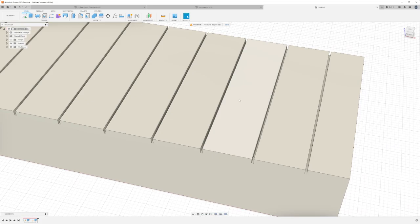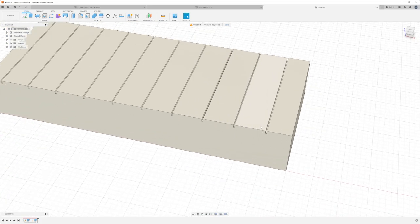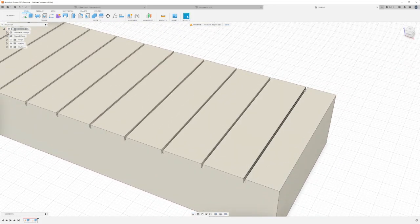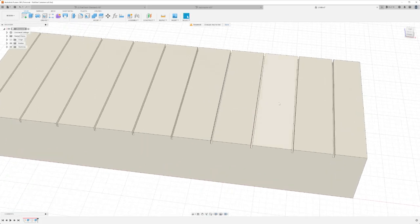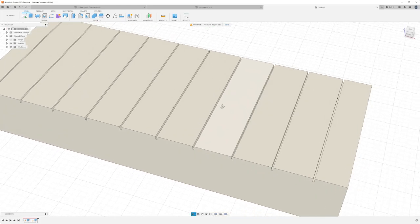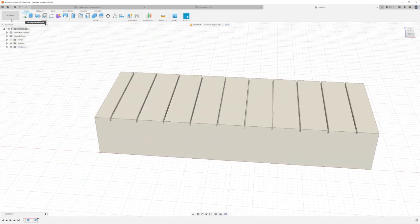These are open-ended frets. This process is a little different for hidden tang frets, where you come in about a 16th of an inch from the edge, because the bit needs to do a plunge cut as well. I think Fusion 360's slot cutting supports entering at a long angle so the bit never plunges directly without ramping. Anyways, that looks good — let's hop into the manufacturer tab.